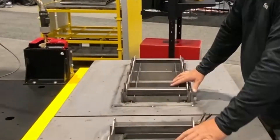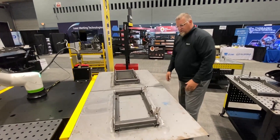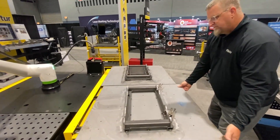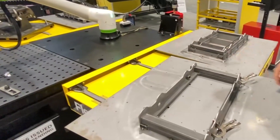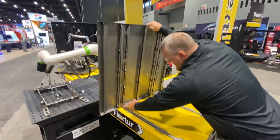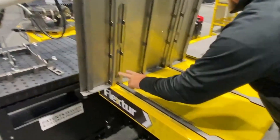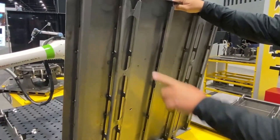The beauty of this is that it's very easily pneumatically clamped into position. I'm just going to open the table here — what I've done is release the fixture plate. You can see we have these clamps on a machine surface back here, and on the bottom of the fixture plate these V's — if you can zoom in here — will align as the fixture gets pushed back. We have it in the front as well.